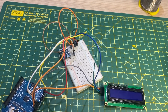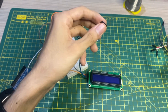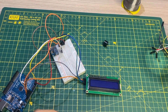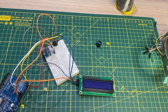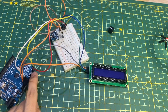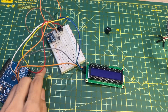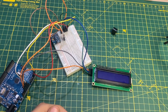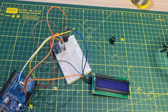I will share the code, so that's it for this video. If you want to use a buzzer, you can — I didn't use one here, but you can use a buzzer or another audio alarm if you prefer. Note that analog pins A4 and A5 are shared by both the LCD and the accelerometer, which creates a small issue but it still works. Thank you for watching.